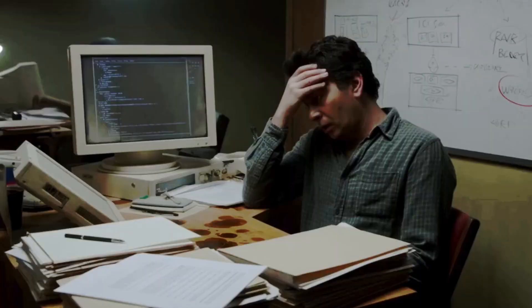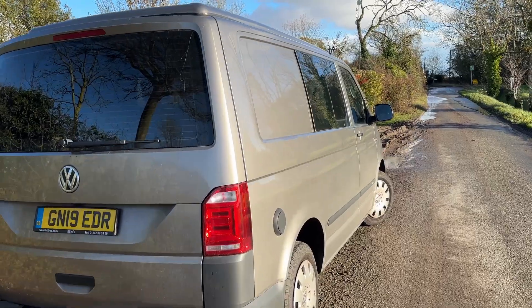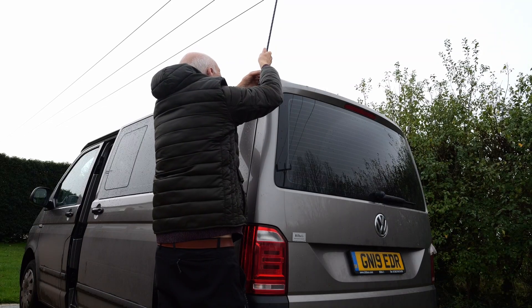I am tearing my hair out over this problem — I've been messing about with my HF mobile antenna. I use a magnetic mount but it is very fussy where I place it, and even moving the cable changes the VSWR. It is so frustrating. Yes, when you're messing about with mobile antennas, particularly with a magnetic mount, you do get some strange VSWR results that you didn't expect.